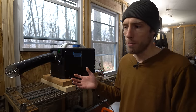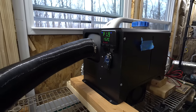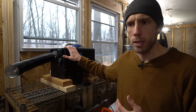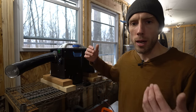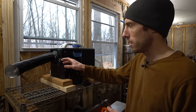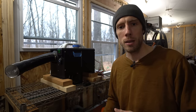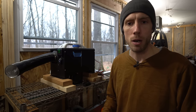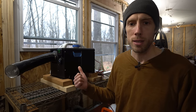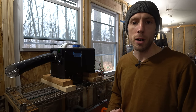How I use this is pretty simple. The little control panel lets you dial the heat up and down, going from very low to about medium-high — around 13,000 BTUs. This thing runs pretty much all day long. In the mornings I come out, it's usually 45 degrees in here with overnight temps dropping into the 20s, and I let this run. It brings it up to about 50-55 degrees, then I turn on the propane stove for a couple minutes to bring everything up to 60 degrees, shut that off, and this thing maintains that for the rest of the day. Then when I go back inside I dial this down.